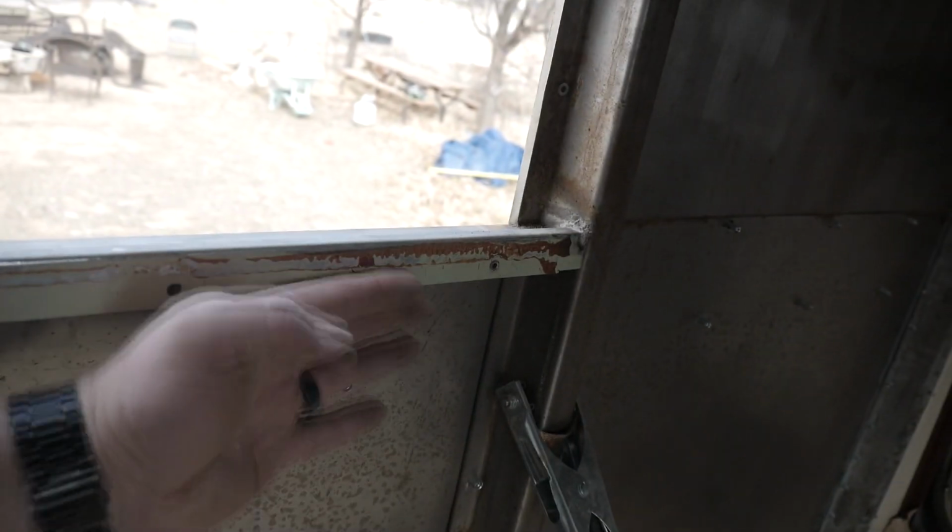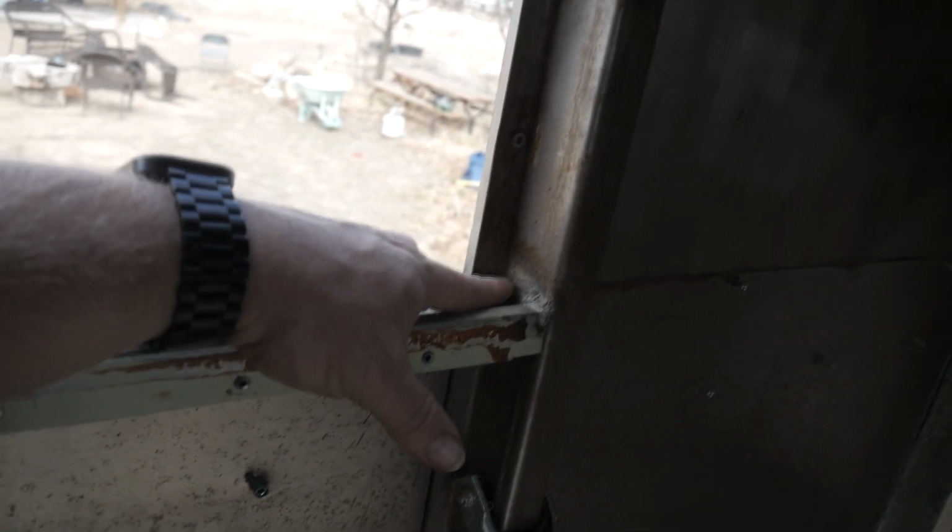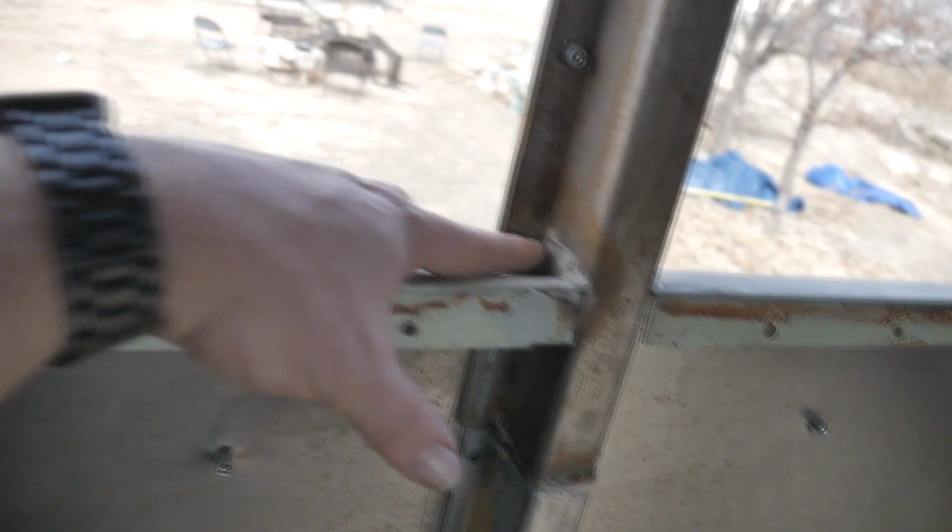This is on the passenger side. We have the rub rail mounted and you can see it's riveted through that new metal and the window sill on the other side. And then what I'm doing, because there's no new sheet metal on the inside going on here like there was before that supported this other edge, is welding the sides of these window sills. Then the insides of these window sills will get attached to the interior strapping that's going to be going down the length of the bus. So it will also get other support in addition to the welding, but that welding plus the rivets on the outside are going to be more than sufficient to hold the entire weight. So tomorrow or this evening we're going to throw rub rails on and it's going to be fantastic.